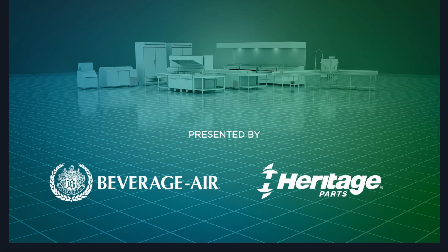LP, it's a different type of propane. So R-290 is propane in essentially its purest form. LP is generally used for heating purposes, cooking. So that's generally used for residential cooking purposes. R-290 is not used for either of those.